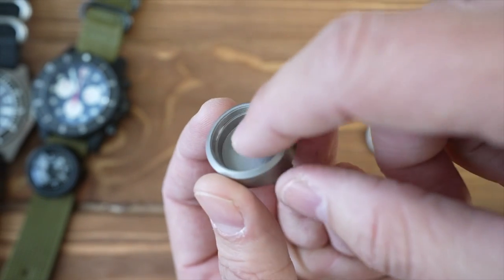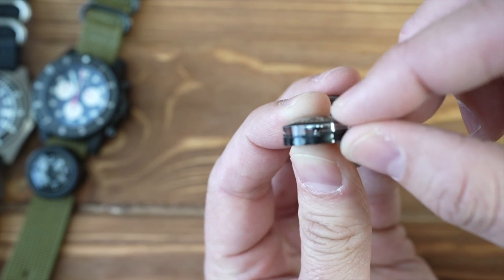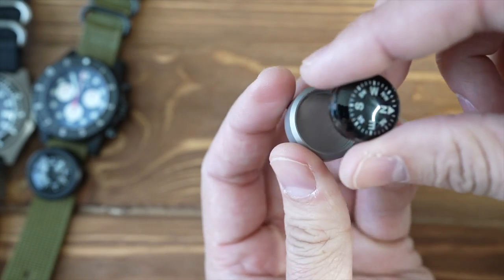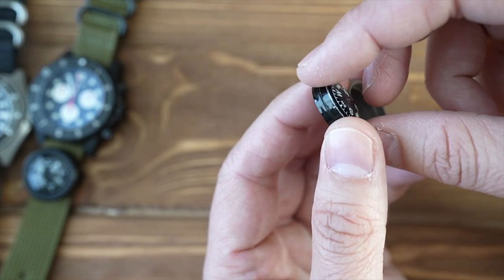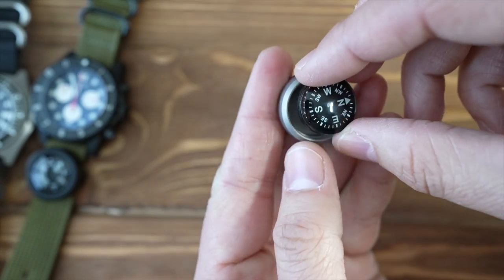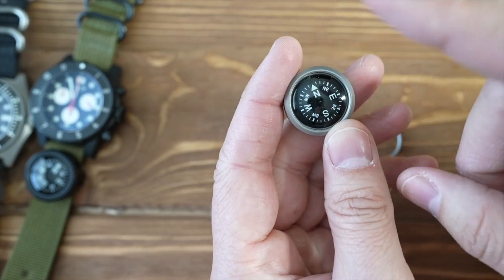Let me show you the inside of the compass. There's a little rim inside that actually fits the 20-millimeter compass. Compasses are made with a split — two pieces of plastic placed and glued together — and a lot of the time air bubbles develop because of pressure. With other companies' designs, pushing it down opens the case and creates pressure against it. What we decided to do is have it attach only to the bottom part, so it's a friction fit. You push it in and even without the bezel, the compass is not coming out.